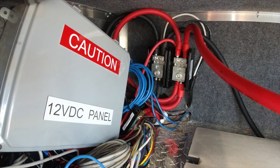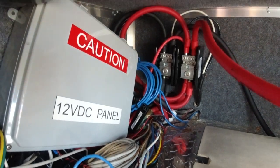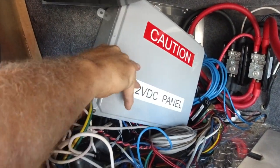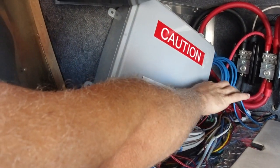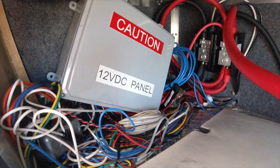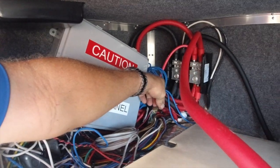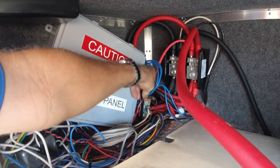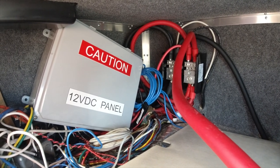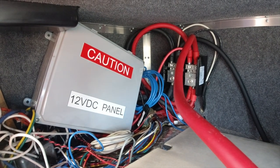You have to have the ability to shut the batteries off, and right now I'm not seeing that anywhere. The DC power panel is hanging out, the shunt is hanging out, and the shunt is literally just connected to DC — it has no power running through it whatsoever. It's not wired properly at all. I definitely have to make some changes here.